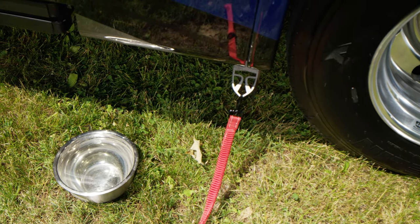Finally, your exterior propane connection — all you need is a cord and you can plug in your grill or a fire pit. One thing to keep in mind is that this is a regulated feed. So if you have a regulator on your grill and you're not getting the flow you want, go ahead and disconnect the regulator from your grill, as this is already regulated.